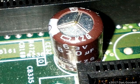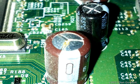This is a failing capacitor. The electrolyte inside is deteriorating and causing the capacitor to bloat. The top bulges upward into a convex shape. In this photo, the black cap in the background is good with a flat top, but the brown cap is bulging and a bit of gold-colored electrolytic fluid is beginning to leak from the top. These capacitors are on a computer motherboard, and although the computer wasn't yet malfunctioning, it would be in a matter of time, so they may as well be replaced before they cause trouble.